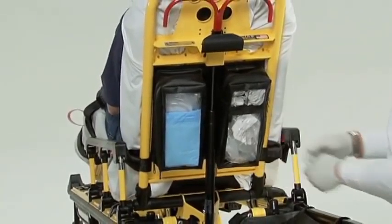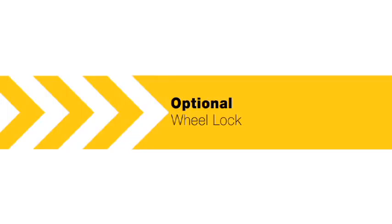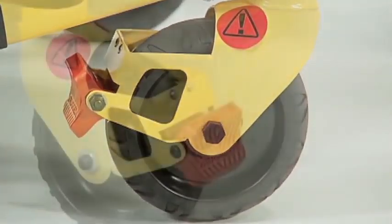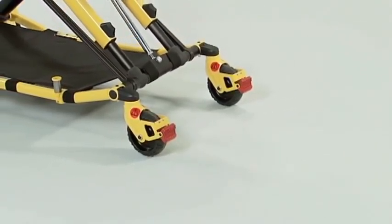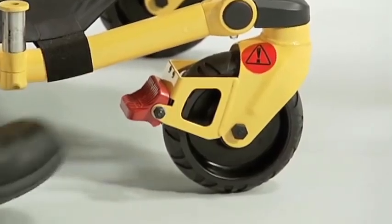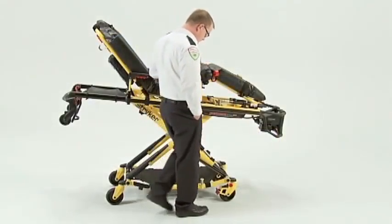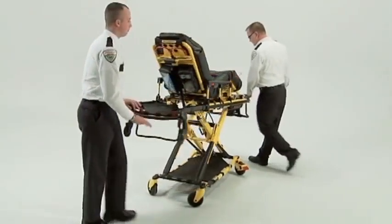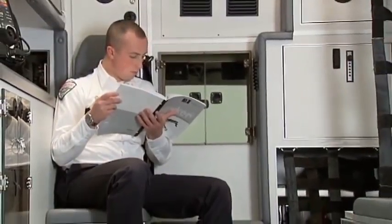The optional equipment hook can be used to hang additional accessories or equipment such as a defibrillator. Each PowerPro XT comes standard with one wheel lock to keep an unoccupied cot from rolling on uneven surfaces. Wheel locks are not intended to secure a patient on the cot and should only be used when the cot is unoccupied. To secure the wheel lock, press firmly on the base of the locking pedal until it locks into position. To release the lock, press the pedal until it returns to its upright position with the top against the caster frame — once released, the wheels will move freely in any direction. Refer to your Operations and Maintenance Manual for step-by-step instructions.